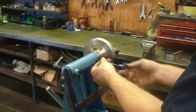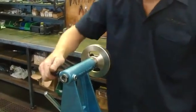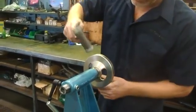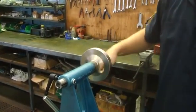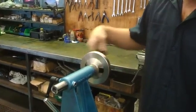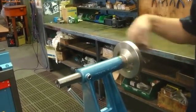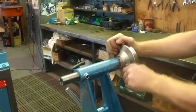After these have been tightened, we can remove the G-clamp and try it to see if it moves. If it has tight spots where it's tight, you just need to take a plastic hammer and give it a little whack above where the screw is, and then try it again. It's fine — still got a little tight spot, so put another little whack. It just moves it away off the back of the tailstock, separating them slightly, which will allow it to move freely. When that locks, you've only got a small amount of movement, which is what you need in there.